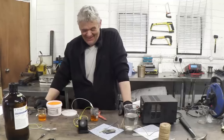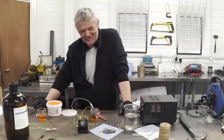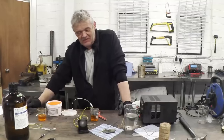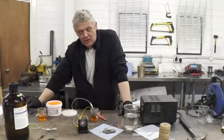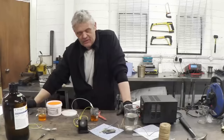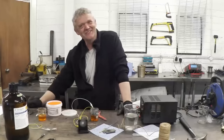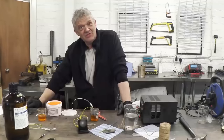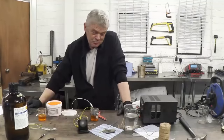See, that is one of the appeals of chromate batteries. They are very energy dense. I mean, if you hear that, that is just belting along and will do so until all of that zinc is eaten away. The disadvantage of them is it uses this horrendous carcinogen. So it is such a shame that that material can't be used because it is just so dangerous and poisonous.